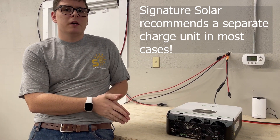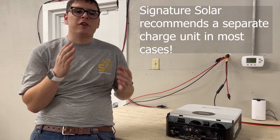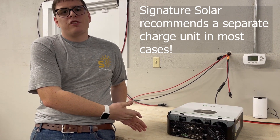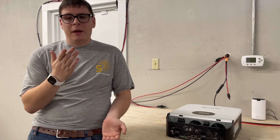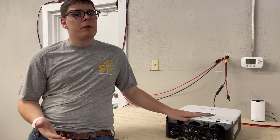This is one of the most important factors for people getting into this. Our typical advice is that since most people don't have inverter generators that big, we don't encourage buying massive generators for battery charging. Use the generator you have and get a separate battery charger instead.